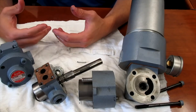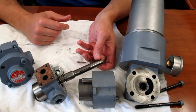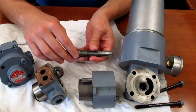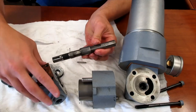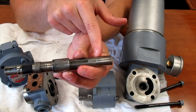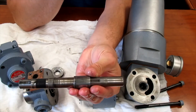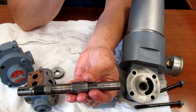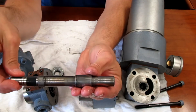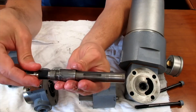If we have a pressure loss or the pump has just stopped turning, there are a couple of things that can happen. After you've pulled out the shaft, you can see on this particular model we have a lot of scoring in the bushing areas. That's an indication this has been run dry for an extended period of time, which will eventually lead to pump seizure. This one doesn't look like it seized, but it had quite a bit of wear in the bushing area.